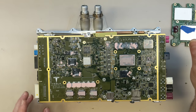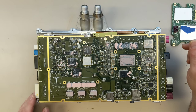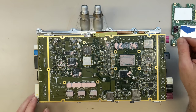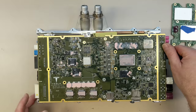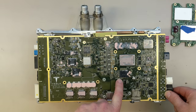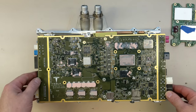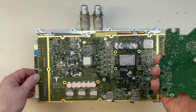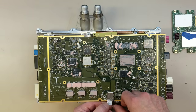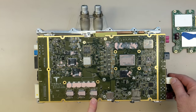It's got 512K level 2 cache per core and 4 MB level 3 cache — it's a special embedded one. The part number will be in the description; I couldn't find anything exactly online, so either it's custom made for Tesla, house marked, or they just haven't released any data on it. We've got voltage regulation buck converters, and this is a 256 GB NVMe module from Micron that provides all the storage for the Ryzen. There's a SIM card socket, though it's not used in the US — they use an eSIM that's part of this module. This is the 16 GB micro SD for the gateway, which stores its logs. We've got three Class D audio amplifier chips with output filters.